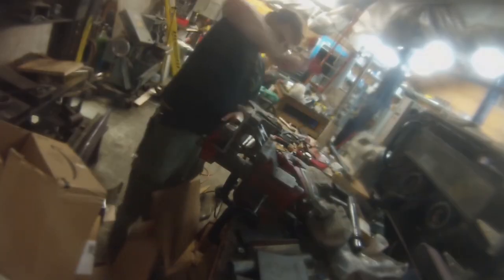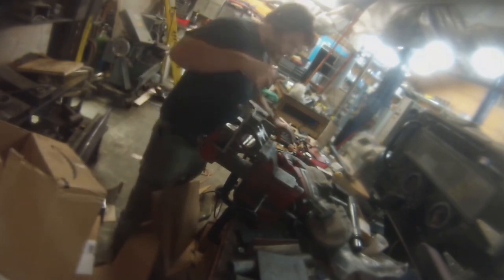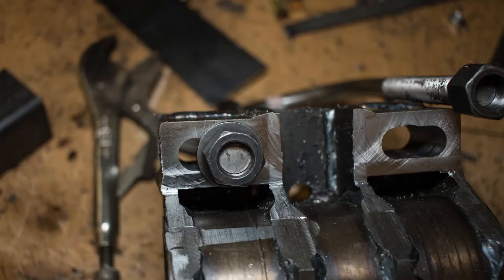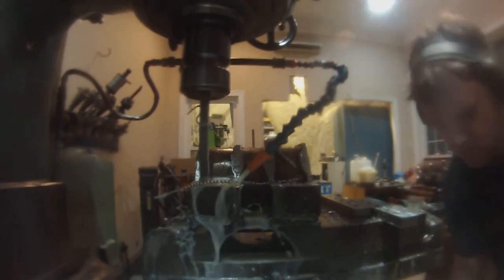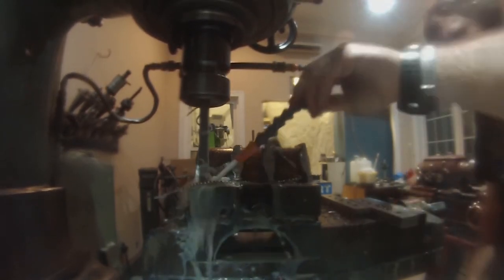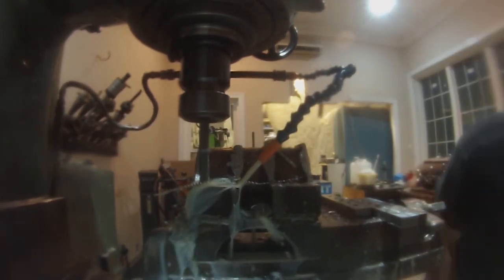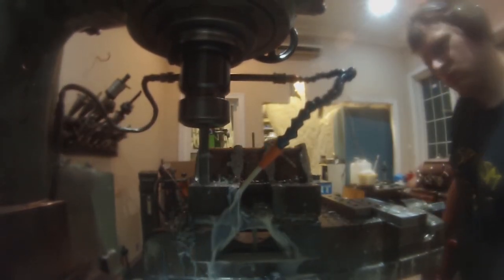Since the mill only took care of the angled cut, I finished the flat bottom cut with a bandsaw, using the U-bolt blocks as a guide. Here we go — this is a better picture of the U-bolt blocks. What we need to do next is mill these slots for this U-bolt. This U-bolt will hold the swing link to the axle tube. Sounds easy enough. I first pre-drill with a half inch drill bit — this will help out the end mill since there is less material to remove and the end mill can't plunge cut. Cheap thing.